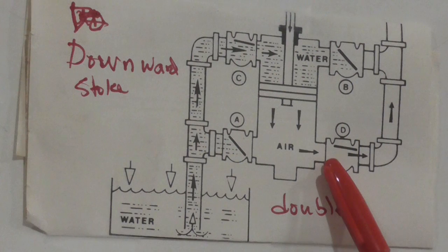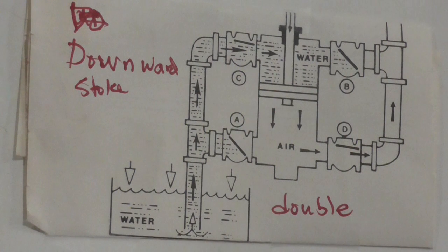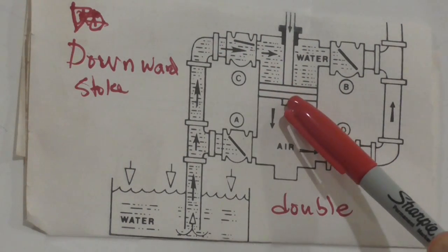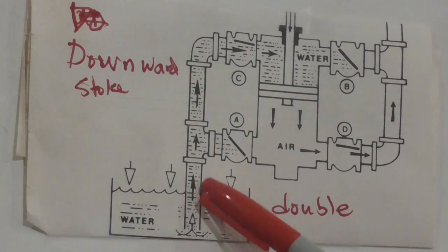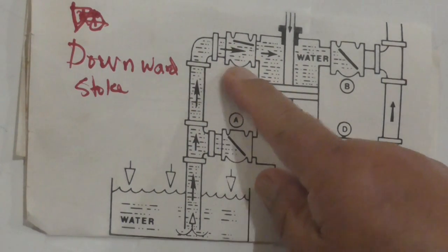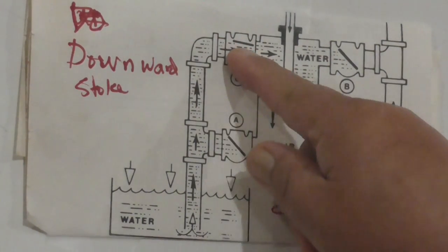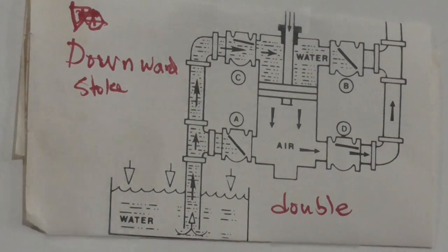And then you have discharge piping here, and then discharge piping over there. Okay? And now we go to the first part. This one right here fills up with water, but the piston now is going upstroke. When it goes upstroke, that means it's discharging this water right here. On the top piston, pressure will build up. It will open this check valve here, and then close the check valve over there. And then it will go to the next stage of the pump,